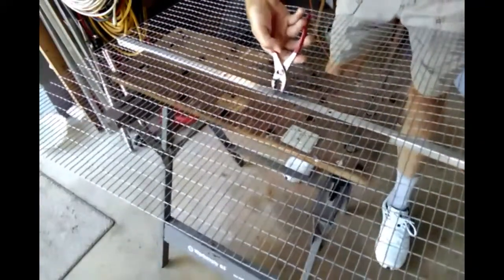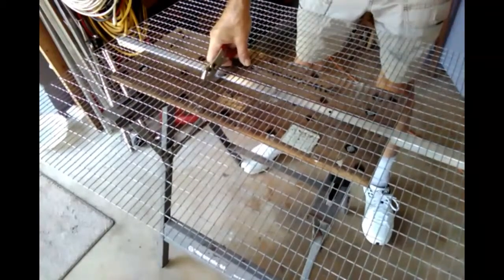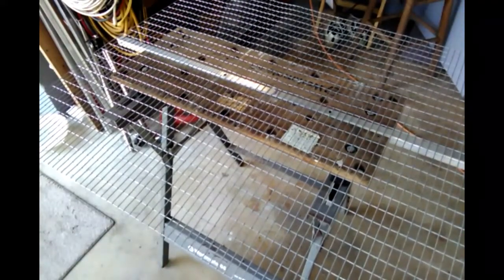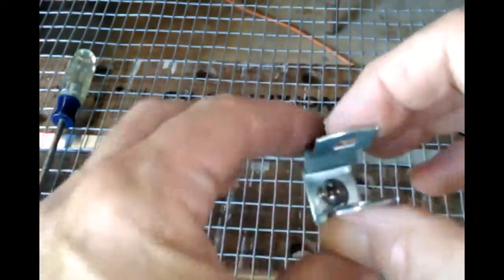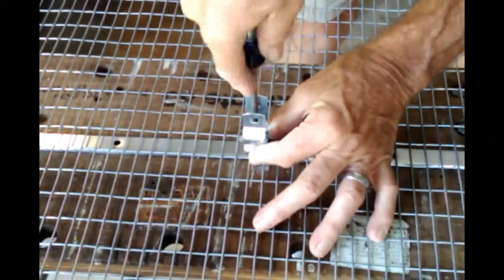What I'm going to do is take a plier — I've got a mark here — I'm going to put a screw and a washer in here. I'm going to pinch these together and also pinch down here at the lower mount and at the upper mount. That allows your screw and washer to hold tighter. Here I have the mounting bracket, and I have a stainless steel screw and a washer that goes in here and I'm going to screw this down. I start in the center — I usually start everything in the center — that way you can align things up better.